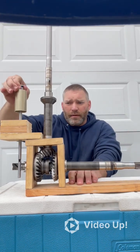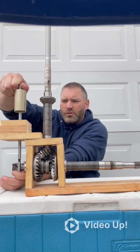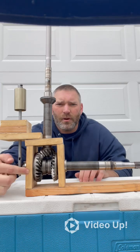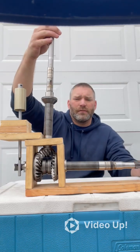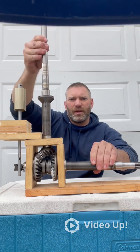And then if you were to pull up on your lever, you'll see that it engages and it'll pull that dog clutch back into a neutral position. So now we're back in neutral. You can confirm that by seeing that the propeller shaft does not spin while my drive shaft spins.